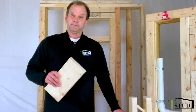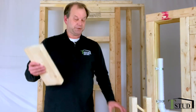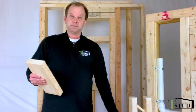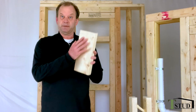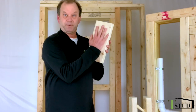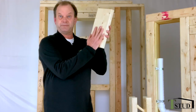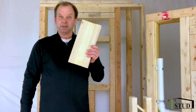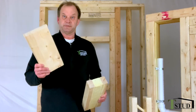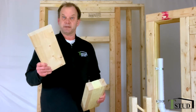When you start framing your wall, start every wall with a two by six and end every wall with a two by six. These are significantly cheaper than an engineered stud. If you start your wall and you have an uplift connector — that uplift connector is big, it sits like a palm — you nail it on and it stops the wall from being able to lift up. We don't have those designed and finalized yet for a T-Stud, and frankly these are cheaper anyway. It doesn't make any difference on the energy efficiency if you start out with a two by six, so just use them.